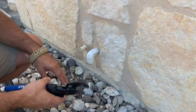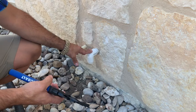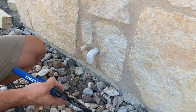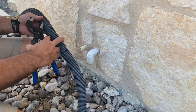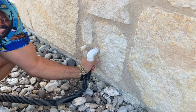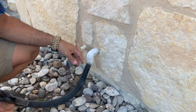The condensate line from that water heater comes right to the outside wall. The shorter the better on condensate lines — the less distance the water has to travel, the better. This one goes down from the water heater and right out the side wall. If I suspect it's stopped up, I can try to clear it with my shop vac right there to get full suction and suck out whatever goop is inside.